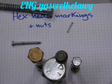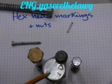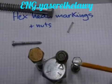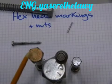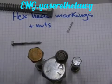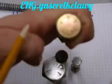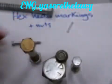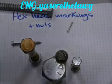What matters here is counting whiskers — these ones. On this one you can see it's got three whiskers on it in a particular arrangement. That one also has three in the same arrangement. This one has six whiskers — one, two, three, four, five, and six. These correspond to the material of the bolt and its strength.